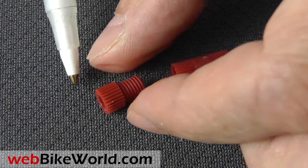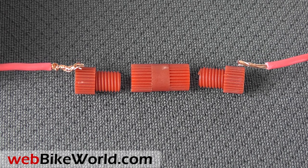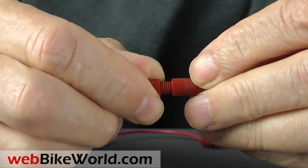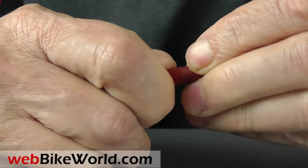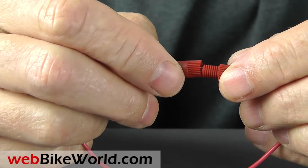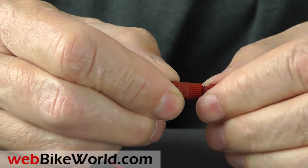The collars are hollow. Here's how the basic POSI lock system works. Slip the collar over the stripped wire and screw the collars into the body of the POSI lock. The metal conductor makes a very strong connection with no soldering, and one of the best features is that they're reusable, making it easy to prototype or add or subtract other wires when needed.